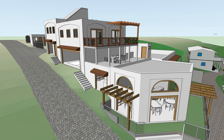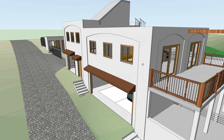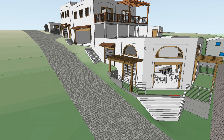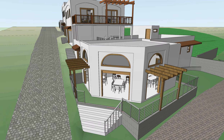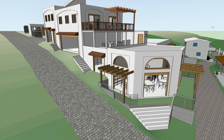Also in the revision are some clarifications for the stucco to be thickened and to form these arches on the facades of the apartment and also on the facade of the cafe. These thickened stucco areas are shown filled with gray in the drawings that were issued, with dimensions to show the shape of the arches and the shape of this squared portion.